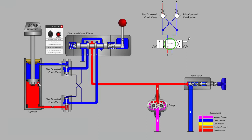In both of the four-port three-position directional control valves that we studied — the closed center and the float center — the P-port was blocked. The use of these valves is typical to what is referred to as a closed center hydraulic system. In many cases, our gear pump would be replaced by a pressure compensated variable displacement pump in order to avoid excessive pumping over the relief valve. In another video, we will cover the tandem center valve and the open center directional control valve.